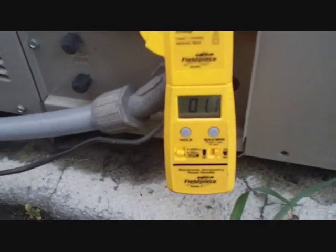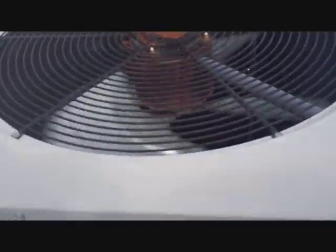The unit's back running. The fan is running at about an amp. Added a new capacitor down there, so I've got to bolt it in. The fan's back on, as you can see.